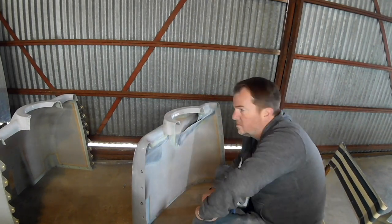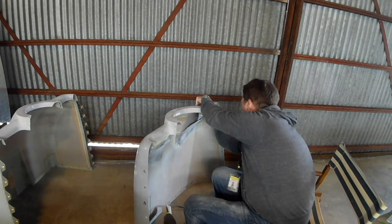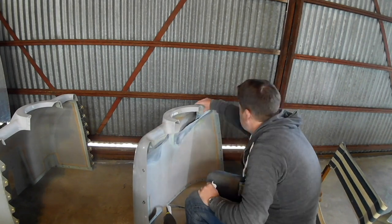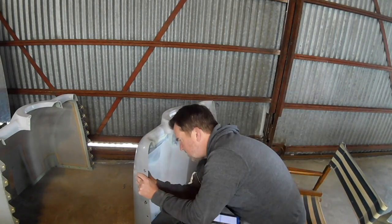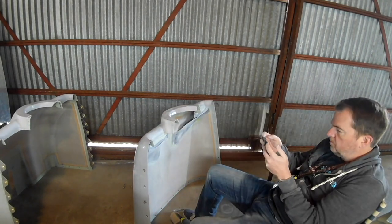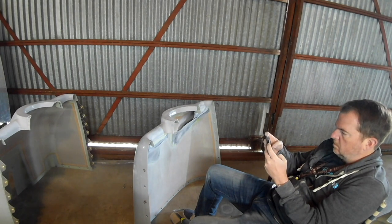What you're seeing me do here is blending in those air scoops — we've got them connected and everything is great. We filled the pinholes in the cowling, so now it's just a matter of getting some more epoxy down there to blend it in so it's one smooth line, which is what you're looking for. All right, I hope everyone's having a happy Monday. In the next video, more things to come — thank you for joining me, see you soon.